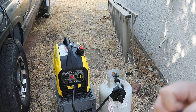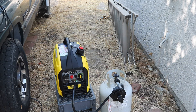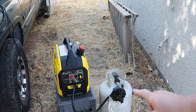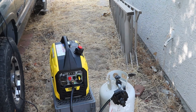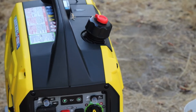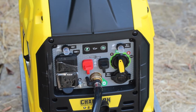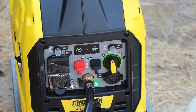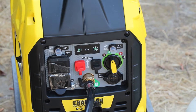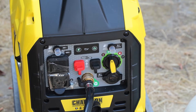The generator really will not want to start until the regulator and the hose are fully primed with propane. The generator defaults to eco mode, and you can see on the front panel that little green light — the one with the little leaf shape right above the red plastic plug. That's the eco light; it means the generator is running at slow speed. That is the default — it will always start and default on eco mode.